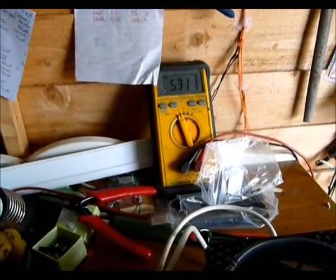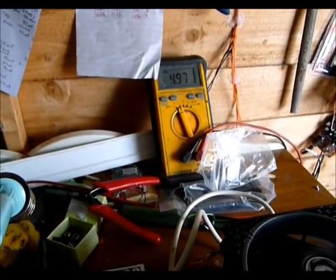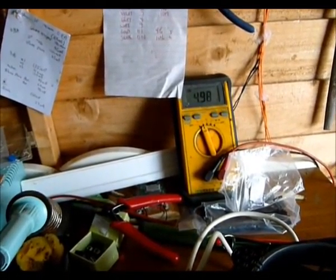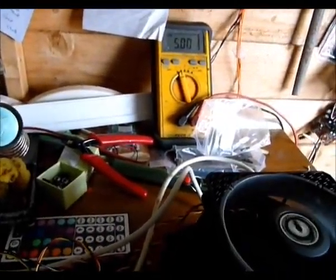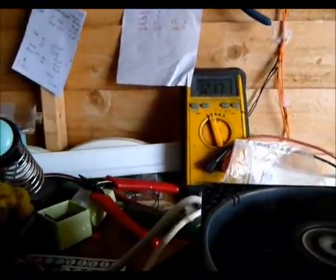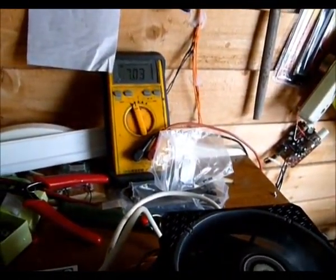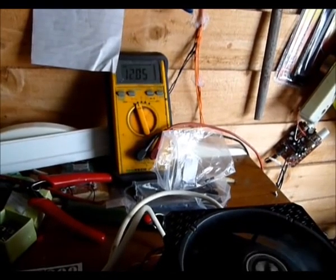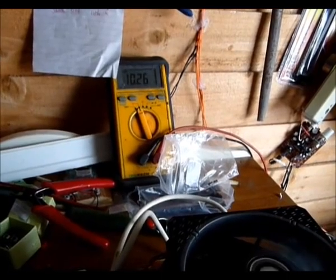It's coming down - let's see if it'll get to five volts. You have to turn a lot here because the circuit works in a log fashion while the pot is linear. Bringing it back up just a touch - there we go, five volts. Kicking the fans back to top speed: there you go. So from five volts up to 12 volts through the PWM cycle - full top range, and it starts to come down as soon as I turn the duty cycle with quite a quick response.